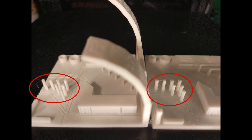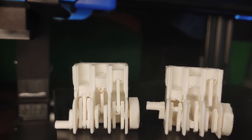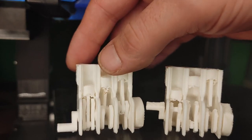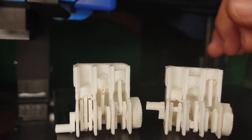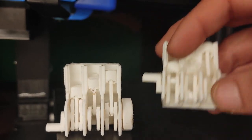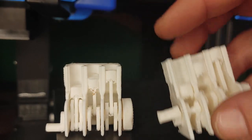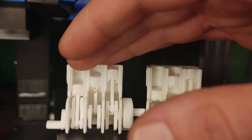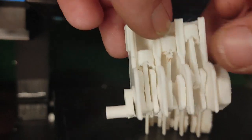This stringing is most likely the biggest artifact of us not changing that retraction setting, because the Artillery Genius is a direct drive machine. So the Ender 3 thoroughly kicked the Artillery's butt in that model. How about printing a print-in-place model with moving parts? Here we have our two engine benchmark tests. On the left the Ender 3 version did have a little singeing or burning of the filament when printing a small feature, but otherwise it came out pretty well — those are pretty steep overhangs on those pistons, basically printing in midair. Unfortunately the Artillery version, because we used horizontal expansion to make sure parts didn't fuse together, we made them a little too thin and the pistons popped right off when I tried to loosen it up. That's kind of the death knell for the Artillery Genius in this test.